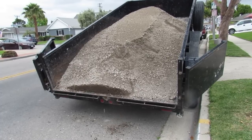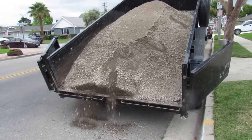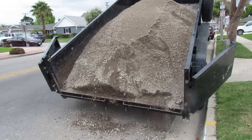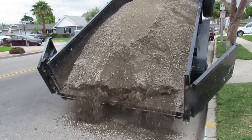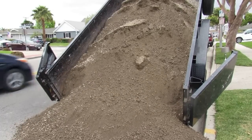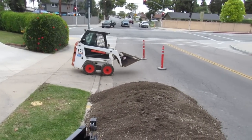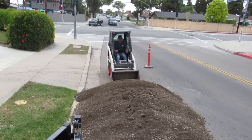I wore it out so bad, and I put it in a footing, and I had another one in the truck. I knew it was going to snap, and I just pried on it, just sheared it right off. But it was like 4 inches where I couldn't get down in it and teeter it, but I knew it was going to snap off, and I had to change it anyway, so I didn't really care. But I always have a backup bit on my truck, but I've never broke a normal size bit ever, and I pry with it all day long. It's just about how you go about doing it.